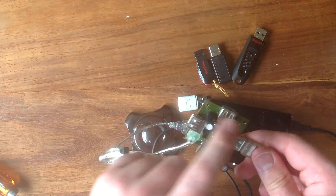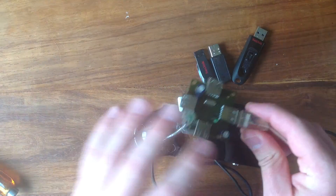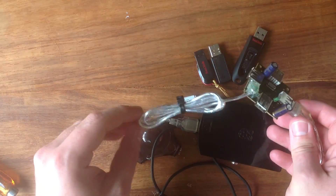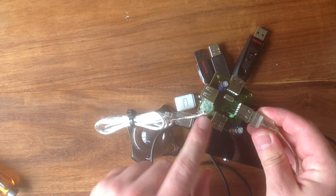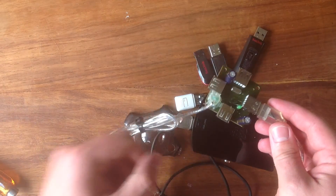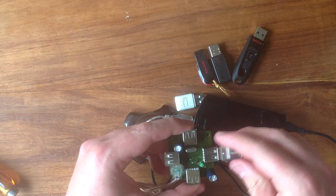This powers all the USB ports at pretty much full power, and the capacitors provide voltage stabilization. Data can be communicated through the USB cable that does not provide any power to the hub, and this does not backwards-power the Raspberry Pi. So, that's how it works. And it's actually worked pretty well.